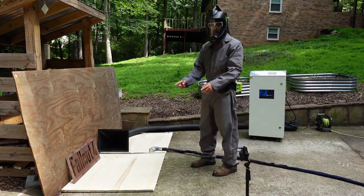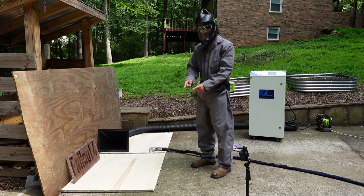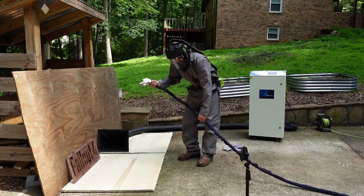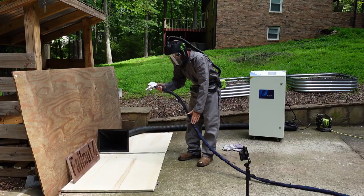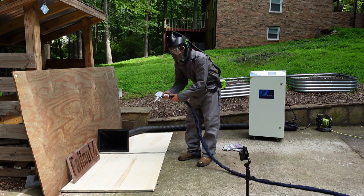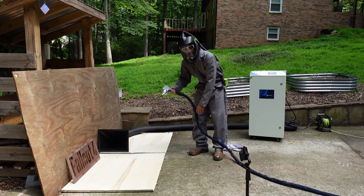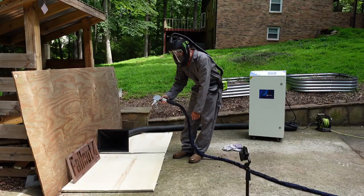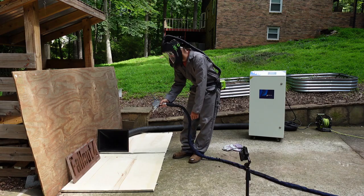I've got the beam width at about 80 millimeters wide and a set speed for the galvo mirror to go back and forth based on the chart they provided. One really important thing is to be mindful of where your fiber optic cable is — it also has the cooling lines going into the head for active cooling back to the chiller. There's a safety feature where one tap does nothing, but two taps fires. I always do a little test first, set the beam shape and distance, and then get into it.